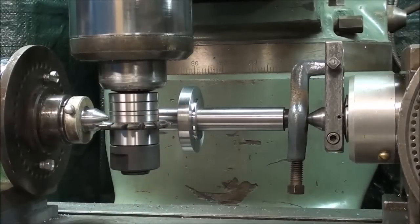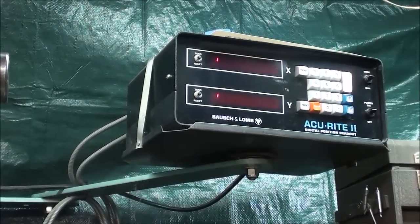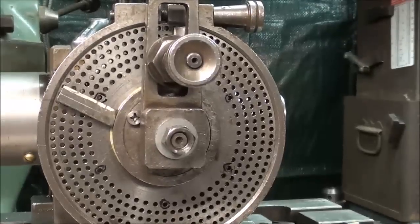The whole tooth depth is 135 thousandths. Having backed this off away from the work, using your digital readout if you have one — if not, you'll have to use the dials — I'm going to move it in 135 thousandths. Right there. I'm going to lock the Y axis, and the only movement of the machine will be allowed in the X axis — that's the direction we're going to be feeding. If you have power feed, you can certainly use that; I do not, so I'll be feeding by hand. Now comes the really hard part: we've got to figure out the dividing — the indexing.